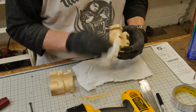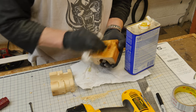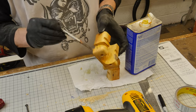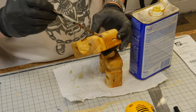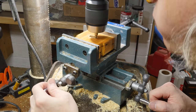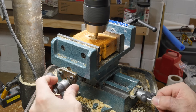The front edge ideally would be done with a router, but I just did it by hand. I'm putting on a little boiled linseed oil to bring out the grain on the wood, give it a nice finish — using a paper towel, and a brush to get down into the little edges and grooves. At this point I realize I probably need a little slot in case I want to run a cable up through to charge a mobile device, so I milled that in rather than drilling a straight hole.